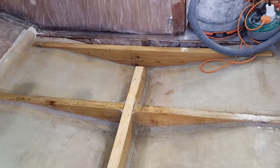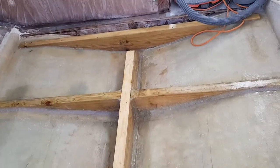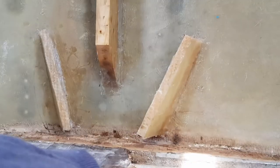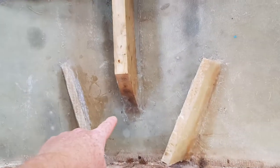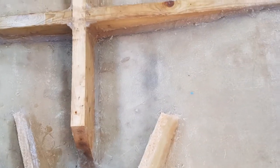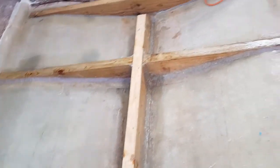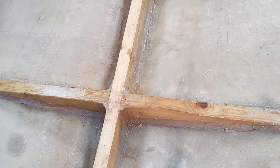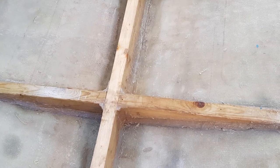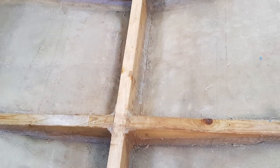So I've been working some more on the sole, or below the sole. We've got all the bulkheads in, and this interesting arrangement down here so that we can have a bilge pump which will be accessible through an access hatch. It's very exciting stuff. It's all been cleaned up nicely, resined, and it's absolutely solid. It's beautiful stuff, completely encapsulated. So once the two panels are finished, I'll be dropping them in here and putting a contiguous layer of glass over the top, so it's one nice big solid piece.